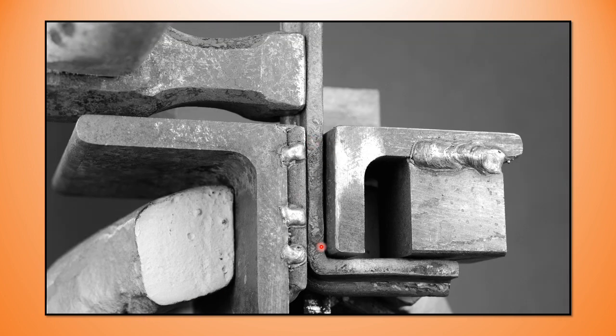So I've made my first bend. All I do now is I've got the heat here in my second bend. I fit it to my jig. I lift it up until the piece kisses my block, and then I make the second bend. And I want you to notice here that my center punch mark is about half the thickness of the back strap above the jig material, and that's right.